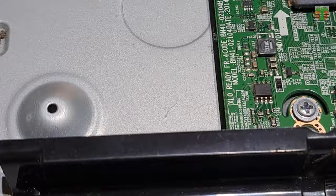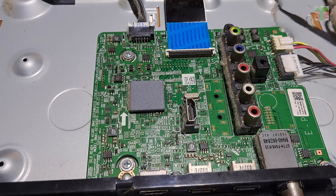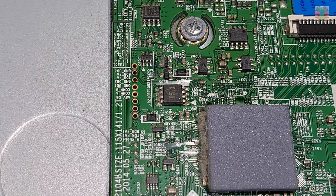No short circuits were found. All voltages seem okay, and no traces of a short circuit rail line. There is another reason for this problem, that maybe the EEPROM program is corrupted. So let's remove the EEPROM memory and try to reprogram it.